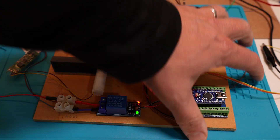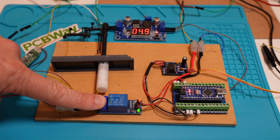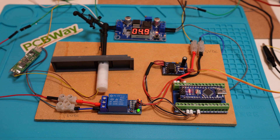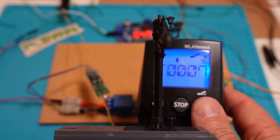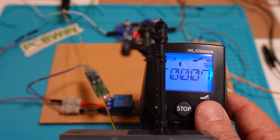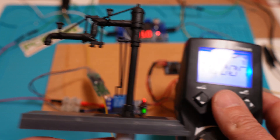Here's a quick rig that helped me put this all together. The first component is the Arduino DCC decoder, then the DCC interface, then the one channel relay, and up top the buck converter. The buck converter brings in the 16 volts and brings it down to 5 volts for the Arduino. I've set it up on address number seven — it's just a matter of toggling through the switch commands. I've got it as a momentary push button so you're using the same input and it just toggles backwards and forwards. It probably would be nicer if it moved a little slower — comment below if you could advise me on how to do that.